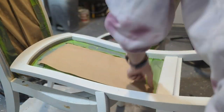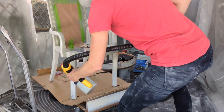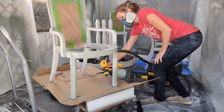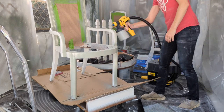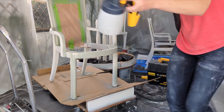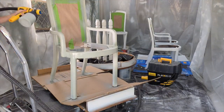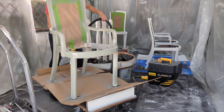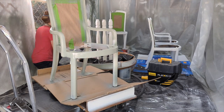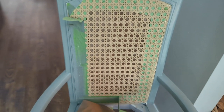Once the chairs are wrapped and everything is wiped with a tack cloth, you can get to work spraying. I'm using my Wagner Flexio 5000 — it's got the finish sprayer, which is a smaller nozzle and it goes on incredibly smooth. It's really great with lacquer. I know you can't really see the green in this lighting right now, but it is the green lacquer going on. When you're spraying, you always want to move with the sprayer — don't move the sprayer up or down without also moving your arm so it stays level. Always wear a respirator because those particles are not good to breathe.